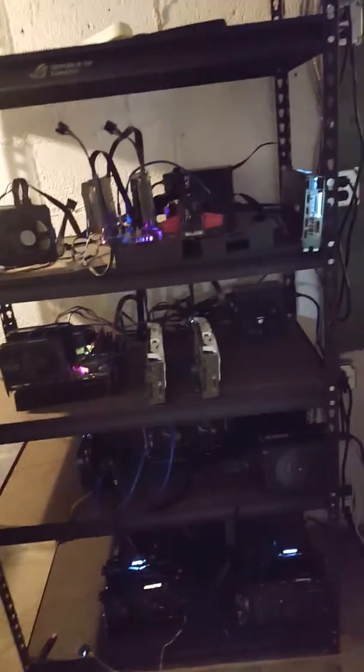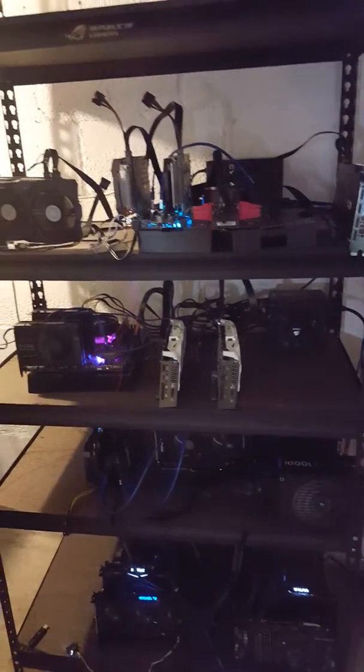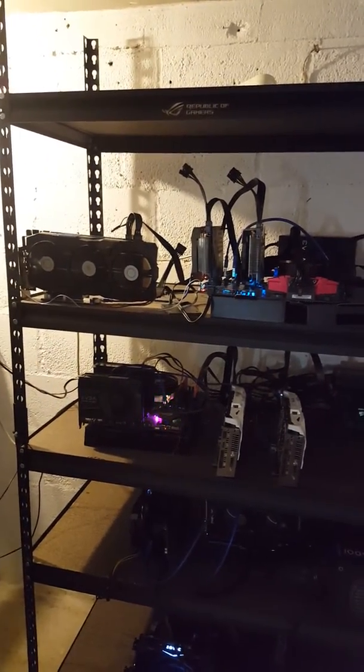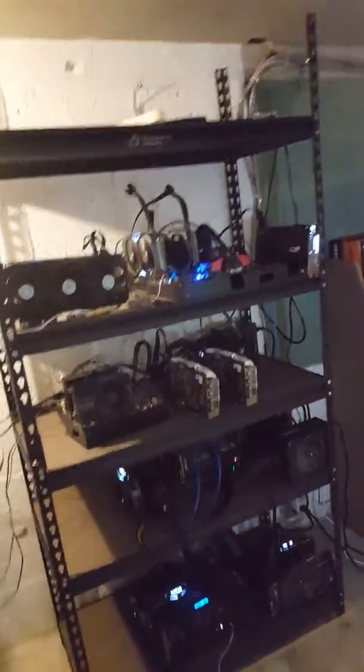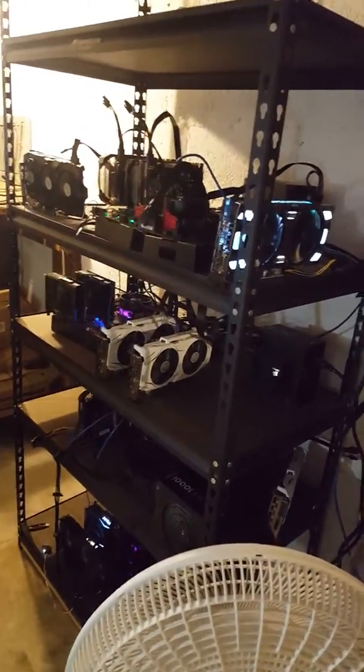As far as using 240 volt, you really don't need to unless you're gonna get a giant warehouse with climate control, because you're gonna run into major heating issues. I'm going to have an air conditioner put in my window to cool the room and displace the heat, but you have to be careful — adding more rigs means more BTUs. An air conditioner is just taking hot air and displacing it, which uses more energy and costs more money. You have to factor that into your ROI, considering thermal dynamics and BTU displacement relative to the square footage of your room.